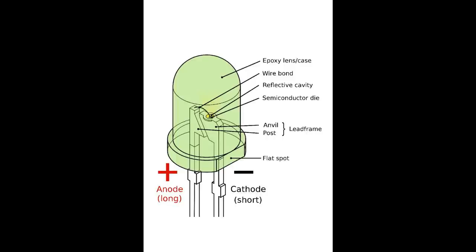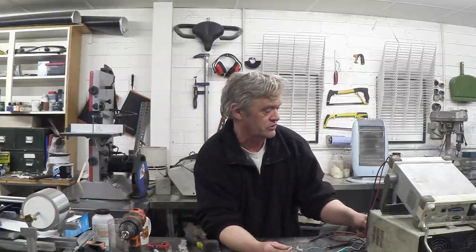This is a light emitting diode. We all know about these — you put a voltage in, it emits some light. Close up, it looks like this. What it is, is a tiny bit of silicon, a tiny bit of semiconductor. When we put a current through, we force the holes and the electrons to recombine, and that emits a photon. So we bang a few volts through there, and presto, it lights up.